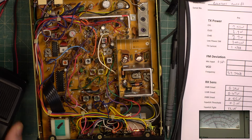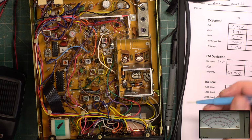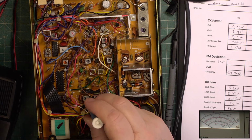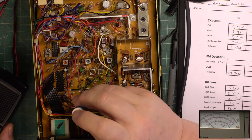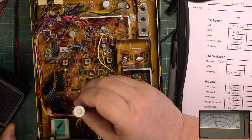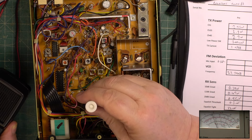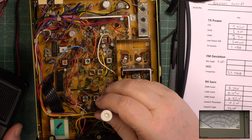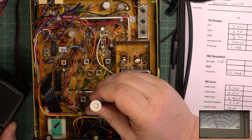So we're now doing 5 watts. So the transmit multipliers, 1, 2, 3. Got to be quick because we're well over the power it's supposed to be doing. So the first one peaked at the center of where we want to pitch. It's about 4.9 now. So it heats up, it drops down. All very good.